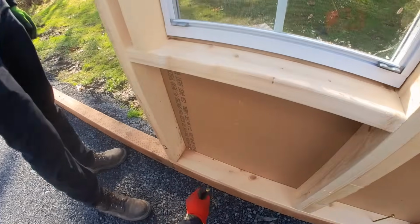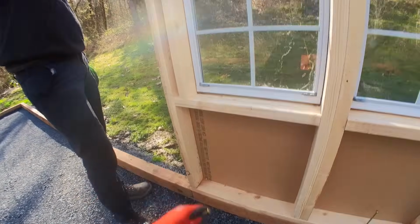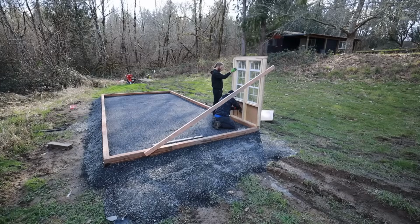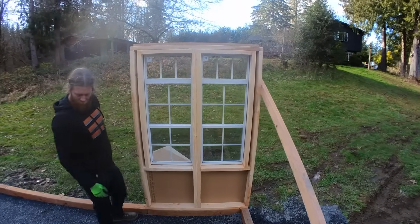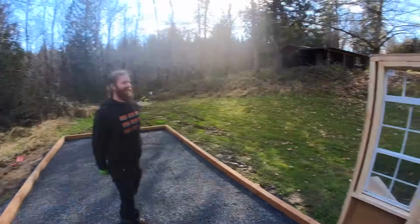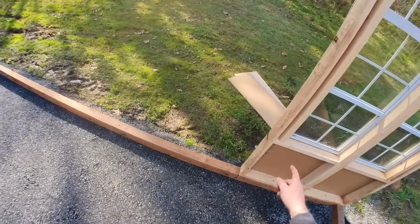I wanted something long enough to go through the top plate, through the top 4x4, and into the bottom 4x4. It just felt like that would be a better connection. Well, we're officially greenhouse builders, Nick. Update the resume. Okay, so now 2 to 3.